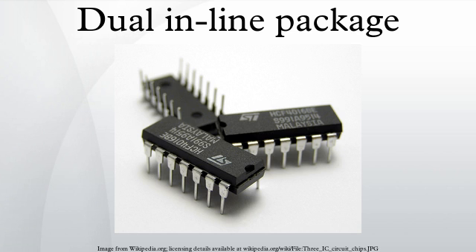If a single bond wire breaks or detaches, the entire IC may become useless. The top of the package covers all of this delicate assemblage without crushing the bond wires, protecting it from contamination by foreign materials. Usually, a company logo, alphanumeric codes, and sometimes words are printed on top of the package to identify its manufacturer and type, when it was made, sometimes where it was made, and other proprietary information.